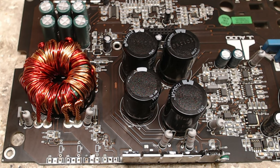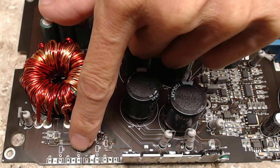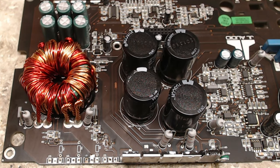I've had a heck of a time from day one with lighting, and I just cannot find a happy spot for lighting. So please excuse any glares that you may have coming off the board. But this board does have a power supply failure. It uses the 3205s, 47 ohm gate resistors, and a couple buffer transistors with some 10 ohm inline resistors that we are going to replace today on camera for you.